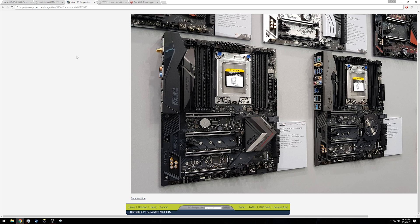Moving over to the ASRock side of things, we have two motherboards: the ASRock Fatality and the ASRock Tai Chi. Aside from the name and a couple of aesthetic differences, they appear to be pretty much identical. Unlike the ASUS motherboard, these are both ATX motherboards. I'm going to focus on the Fatality, keeping in mind the Tai Chi has the same feature set listed. Physically we again have eight DIMM slots for RAM, and unlike the ASUS board we actually have three M.2 slots — the first below the second PCIe slot, and the second and third just above the last PCIe slot.